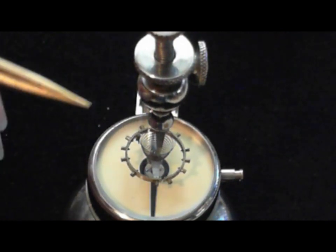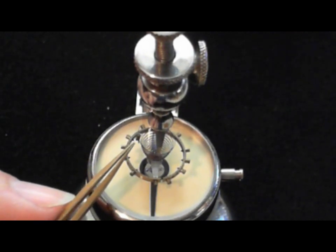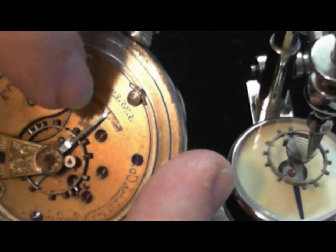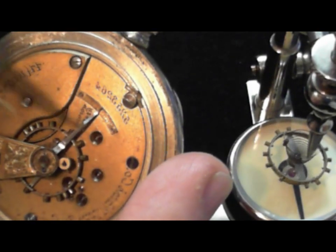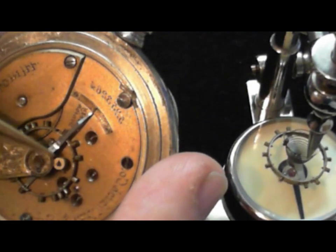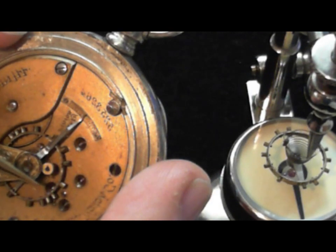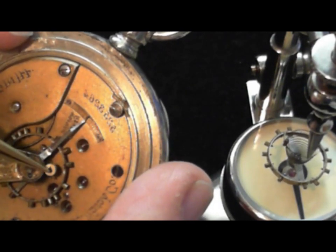Normally this is for studding a hairspring, so the stud wouldn't be here — you just have a hairspring. You've got to leave enough hairspring to stud it on the end and put the pin in, and then have this distance be the exact center where the regulator arm is. You'd want to take this old watch as an example — this regulator arm would be in the center. The distance from where these little regulator pin arms are to the stud is what you want to be measuring while this is absolutely in the center. If I've pinched this perfectly and there's leftover spring, I have to measure the distance from the pinch to where the stud's going to be — I want to leave about 10 millimeters of hairspring on the end before I stud it.